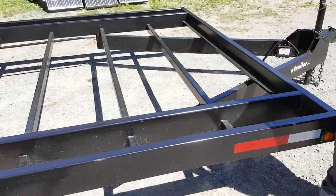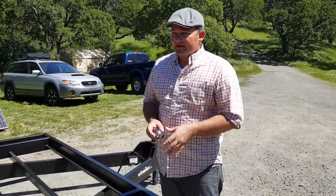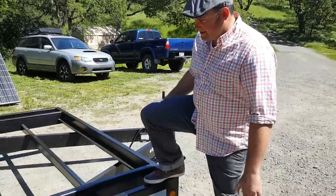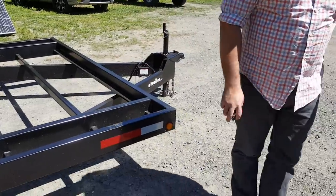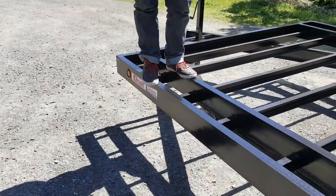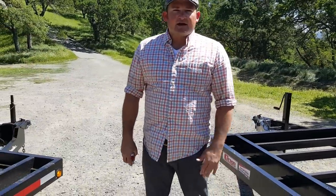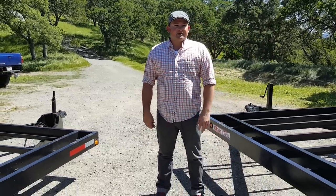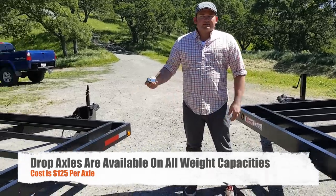This main four-inch difference may not seem like a lot, but it is when it comes to building the tiny house and having space in the loft. The entry into the tiny house is a lot easier — you can see on this one it's just an easy step up into the house, whereas on the standard trailer it's a much higher step. You're going to gain about four or five inches of loft headroom and have a lower, easier approach inside, with fewer stairs to build. There are a lot of benefits to getting drop axles on your tiny house trailer.